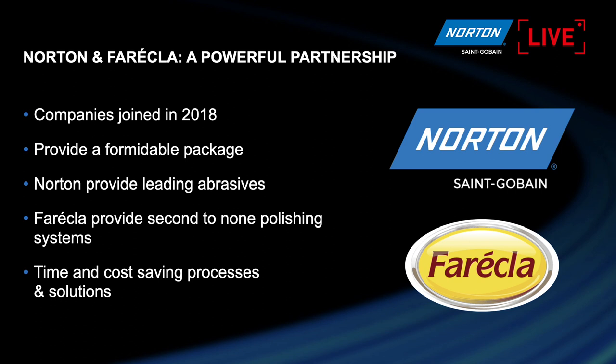As a rule, resins are much stronger when used for tooling gels to withstand heavy use, and they're more soft for production gel coats. Traditionally, we're talking about epoxy, vinyl ester, and polyester resins. So the hardest being epoxy and the softest being polyester.